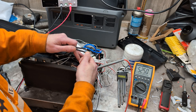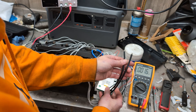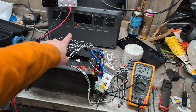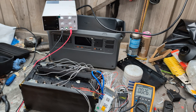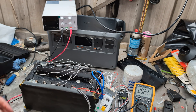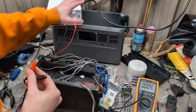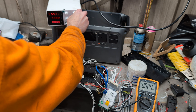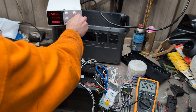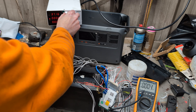Via the Bluetooth interface you can turn it off or down at least. The only thing I haven't tried so far is charging it, which is connecting up the power supply — just slightly out of shot here. What battery voltage do you charge a 52 volt or a 48 volt battery? Is it 52 volts? Let me just go and Google that. It says 58 point something volts. So let's take our power supply and take the voltage up to 58 volts — 59 volts. I have no idea what the current is set to, so I'm pretty sure it's something low.